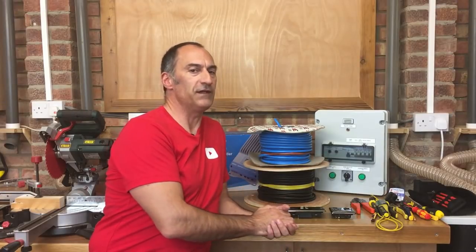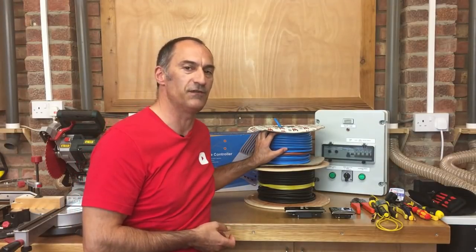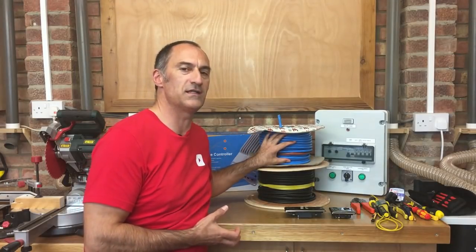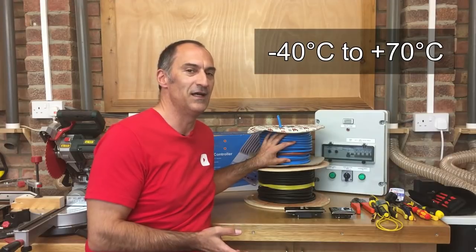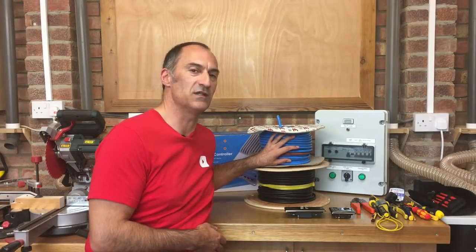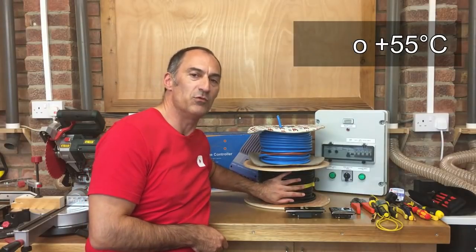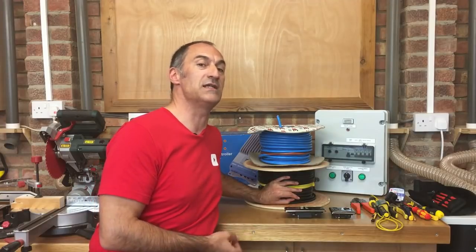In terms of cable we're going to be pulling into the van, I've gone for two specific types. What you see here is called arctic blue cable - this is what I'm going to use for the mains voltage to feed all of the sockets and to feed the fridge and heaters. This is a 2.5 millimeter three core flex but especially rated for a much wider temperature range - it goes down to minus 40. It's much more suitable for outdoor use and is typically used on boats and caravans. On the 12 volt DC side I've gone for a very similar robust cable with thicker insulation, far more suited for outdoor use - I'll put the specifications of both cables in the description below.